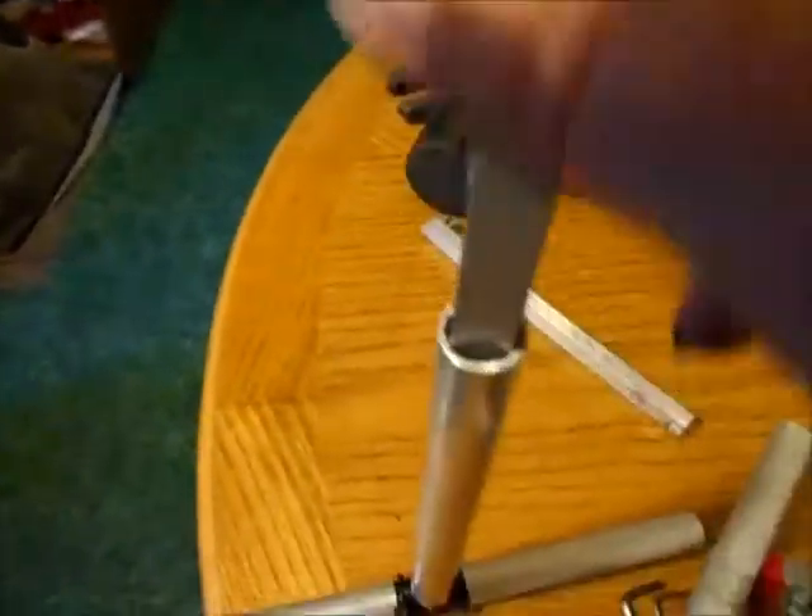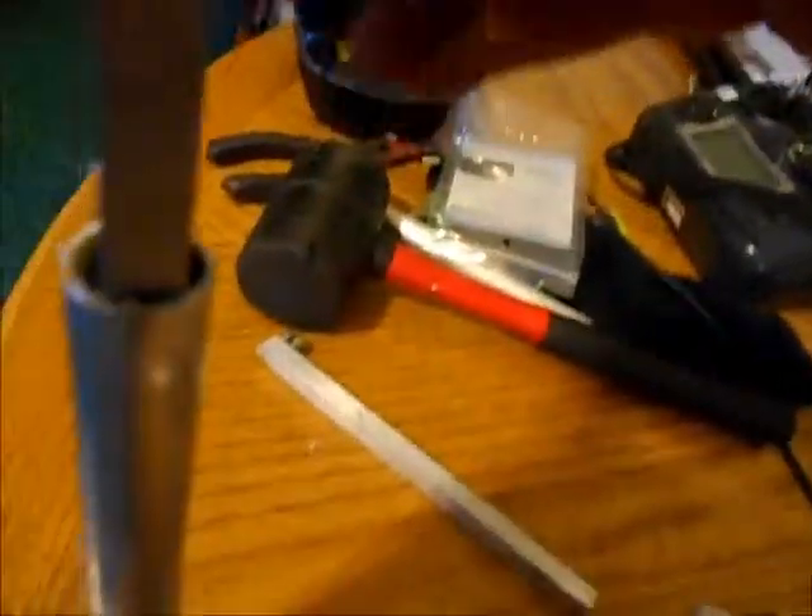That'll fit down this tube real nicely. We'll use another piece — that fits down in that tube. What I'm going to do is put a spring down here that rests on the T, and runs up this high, then this would go up and down on the spring. In order to keep it from taking off and pulling all the way out, I'll put a stop screw through this thing and a guide screw that goes into the channel through here, so it always goes up and down straight.